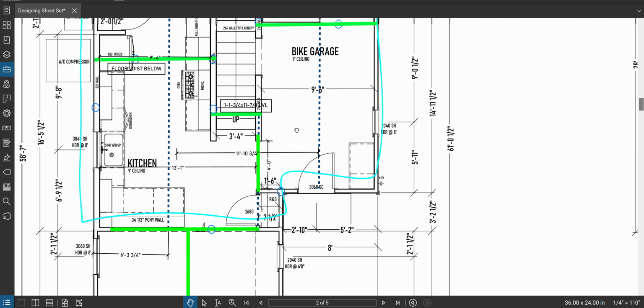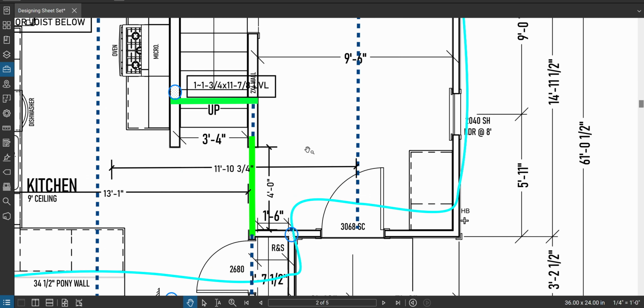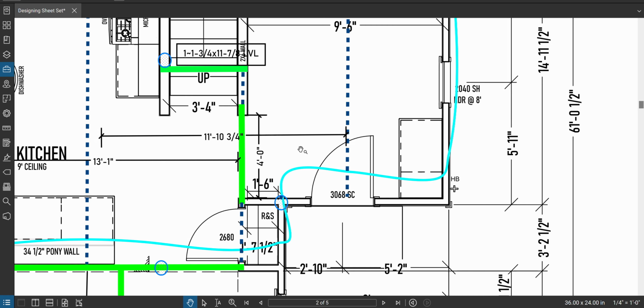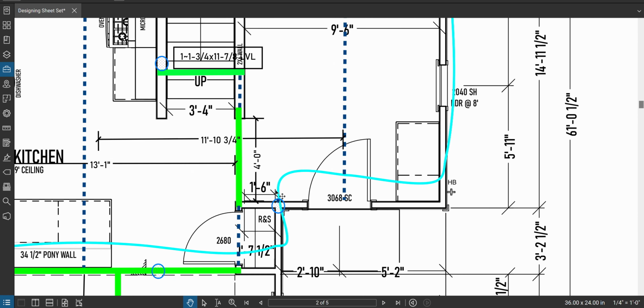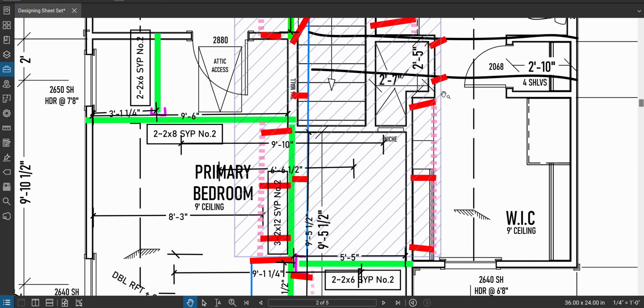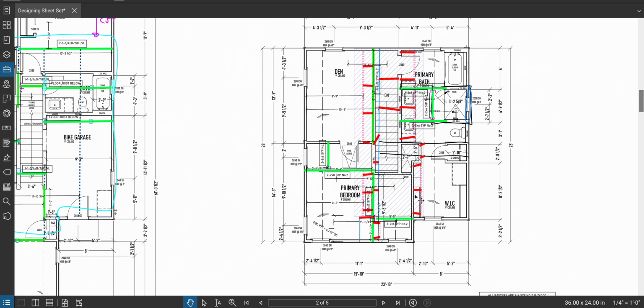But aside from that, that's going to matter because that load is going to increase the weight of what's on here, because there's a little bit that I'm responsible for. So I'm going to simplify this in terms of math, and since my roof load's coming down right here, I'm going to pretend it's on my beam instead. That's going to over-design my beam because the load's actually on the joist, which is going to send some of the weight this way. But it's close to this beam, so most of the weight's going to come on the beam. All right? So I'm going to assume this purlin load and all this weight is going down onto the beam I'm designing right now.